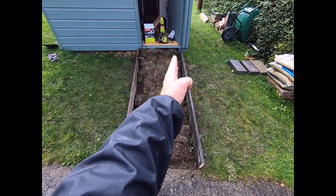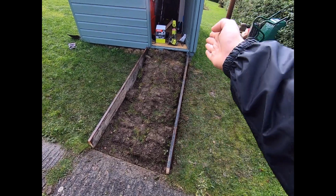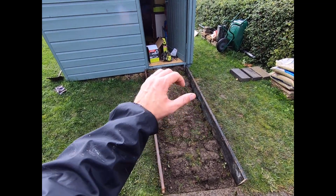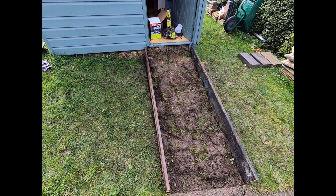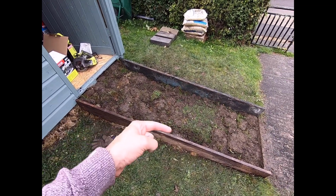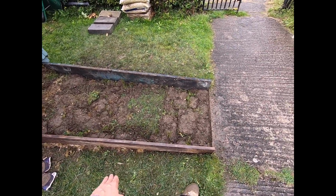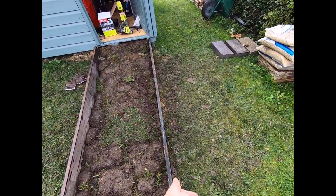And now I've just padded the inside here. What I'm probably going to do is infill just up the outside line of the trench on each plank, just to give it support on that side as well. But I think once the stones and the slabs are in place, this will hopefully just keep this in place quite nicely. So I've now got the planks secure. All I've done is basically press down thin bits of turf right the way down into the outside of the trench, and then packed up the inside as well on both sides.